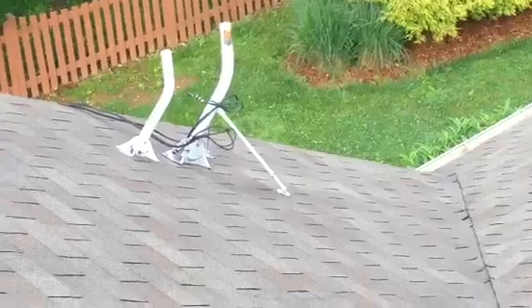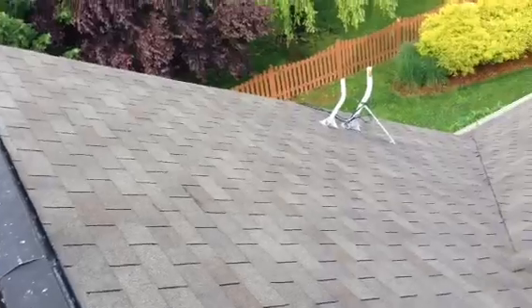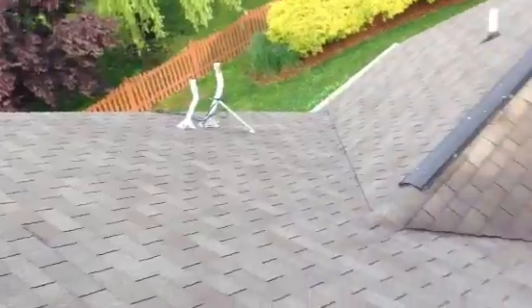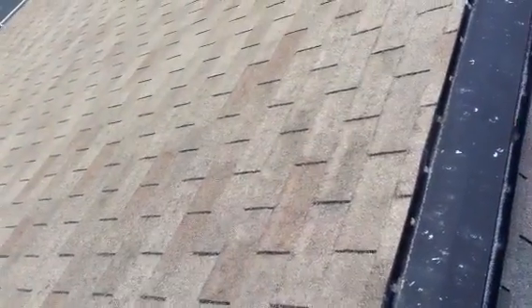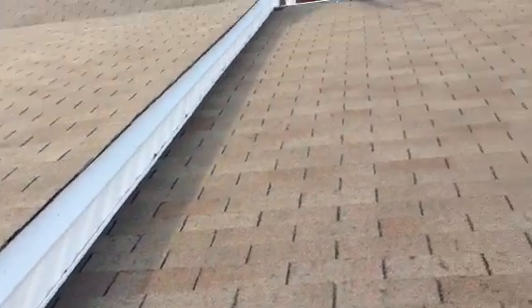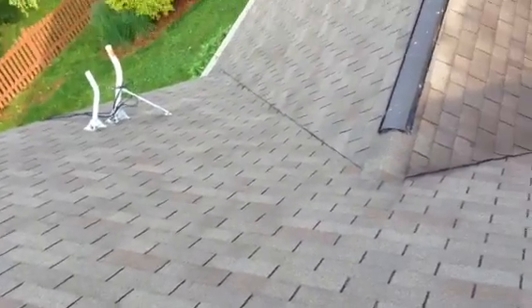As far as the life of this roof, I would say that this roof is good for another three to five years and will need to be replaced. Once the granulars start coming off — and the front side is obviously the side that takes the sun at the hottest part of the day — once these granulars start wearing off like this, I would say five years tops, this thing's going to need to be replaced.